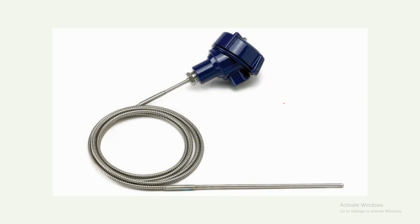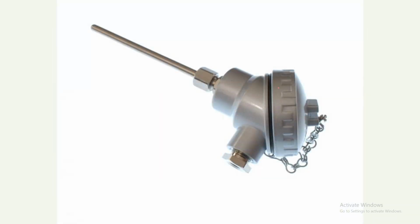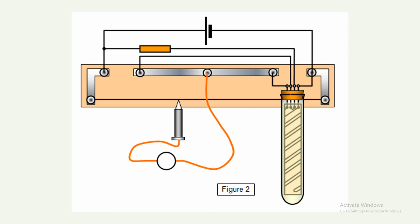And then we have another case here. This one you open just to expose the other parts I've just talked about. And then here, this is a simplified version, like the one you may use if you are to do this in the laboratory. This is a center zero galvanometer. You can see the dummy leads. For them, we just connect dummy leads. Then this and that, you wind around these mica strips, and then at the end you connect them like that. It's that easy. Very, very easy.